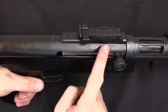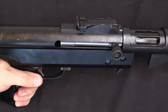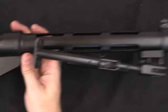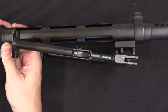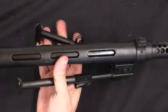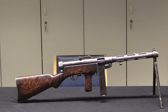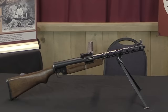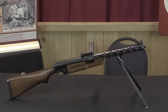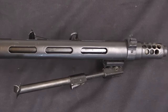We need some sights. We've got the rear sight from the Suomi, which matches up nicely with the front sight already on the barrel shroud. You can stick a little piece of Picatinny rail out there so people can put on a bipod. Is this strictly necessary for a submachine gun? No. However, interestingly, there were original versions of the Suomi built with bipods as a factory option, as well as some other guns like the Czech ZK 383 — the so-called heavy submachine gun with a bipod. And it certainly makes it more fun to shoot, laying the thing down for good directed aimed fire.